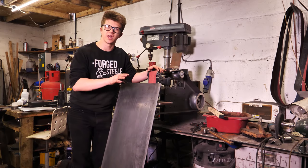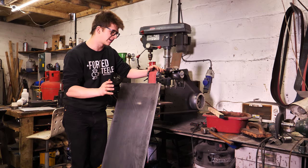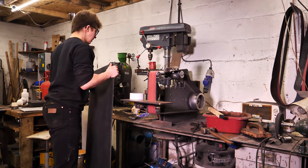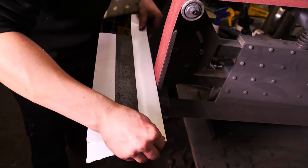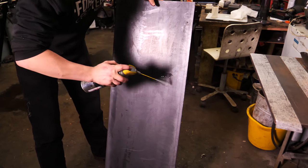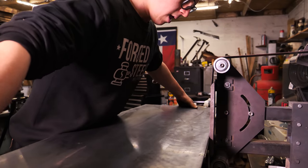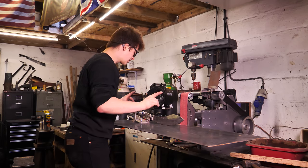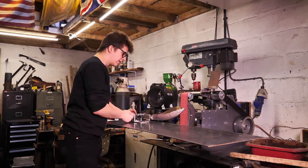So it's really crucial you use a high-grade piece of steel for this. This is 15N20, same steel that I make my Damascus steels out of, and that's really essential. I made sure that I picked wisely when deciding the steel choice. So, I think that and a little double-faced tape. So I've now prayed to the Nepalese double-sided tape gods. We're all set. I've made sure that my flats are square with this, yada yada, we're all good. So let's give this a go.